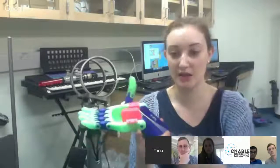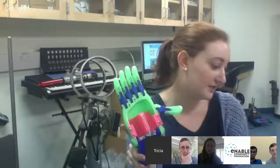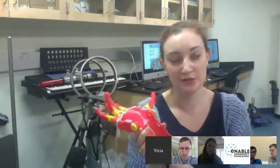In the meantime, we've done a few general tests as well. We're still narrowing down our testing protocol, but we've finalized a list of the functional things we want to see whether the hands can do. We've come up with some rough numbers. We tested some of the 1.3 sized Phoenix and Raptor Reloaded hands, and both take about 13 newtons to become completely closed. When you pull back and get the hand fully flexed like this, that is about 13 newtons of force. The Phoenix hand uses that adaptive grip, and we found it only took about 6 newtons of force to hold objects, whereas the Raptor Reloaded hand we tested was a little more difficult to pull, probably because of the black elastic in the back of it. Again, to keep it fully closed is about 13 newtons of force at the end.